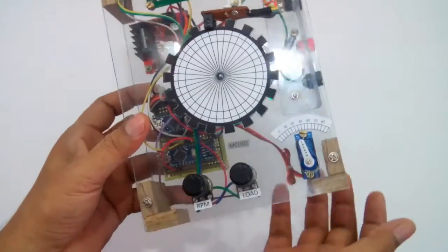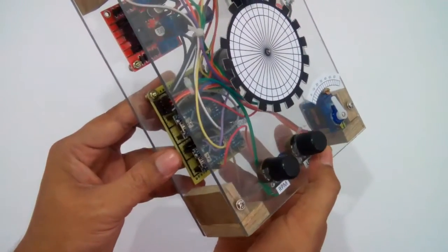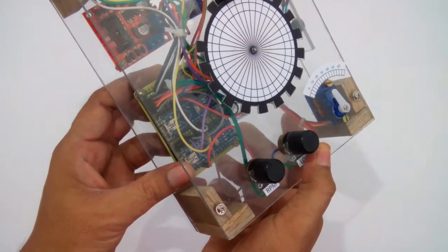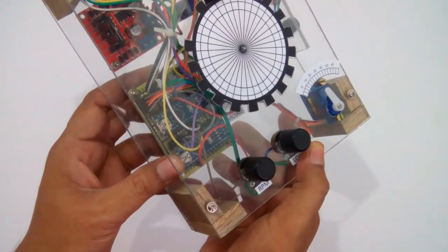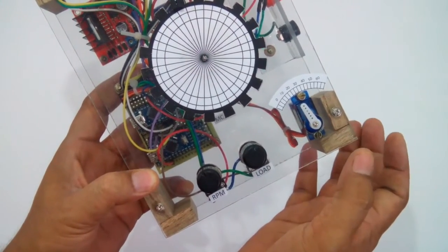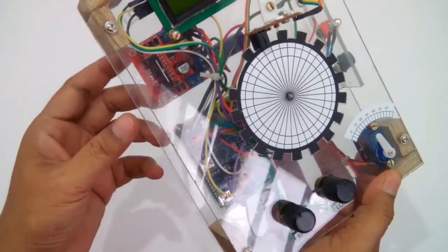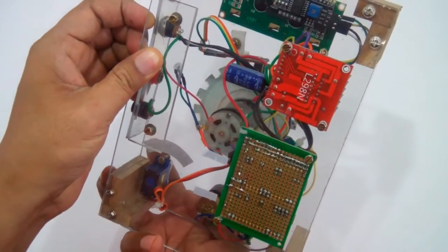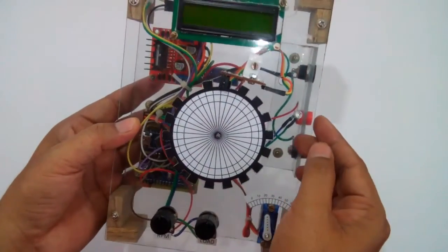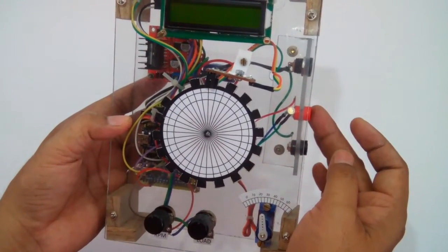To control the speed of this motor, we can control it from there. The knob is managed by the Arduino Nano — I'm using two Arduino Nanos: one is the main and the other is auxiliary. The auxiliary Arduino Nano controls the motor speed and indicates the spark plug lead angle. A servo is used just as an indicator for the angle. To control the motor I'm using an L298-based motor controller. The project also has a small LED that indicates the RPM or spark speed.